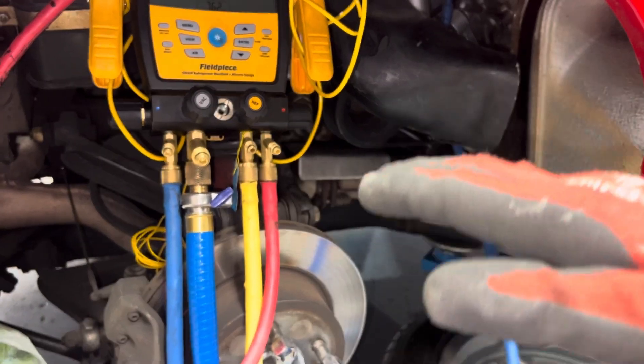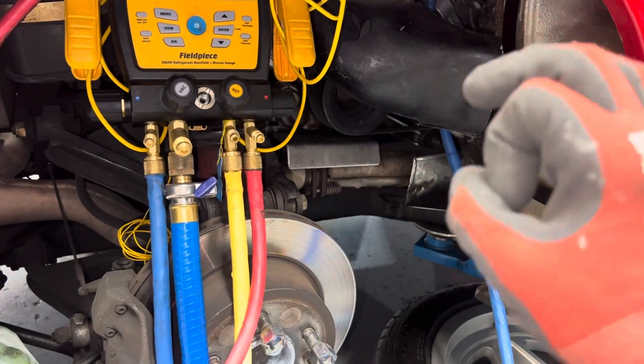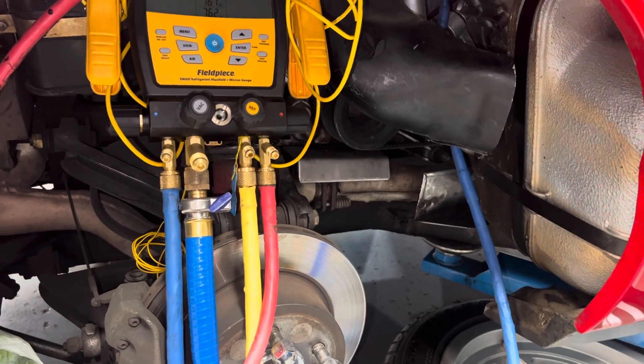It's not because ice formed on the outside — that's a different problem that limits airflow through the coils. This is literally internal, on the liquid side inside. As the liquid leaves the expansion valve and flashes cold on the other side, depending on pressures and temperatures, you can literally form ice crystals on the inside. I've seen that before, and you can usually fix it with a good evacuation and changing the receiver dryer.